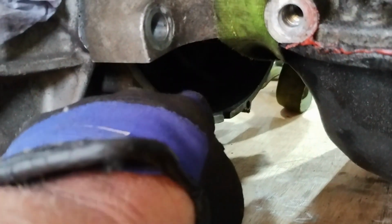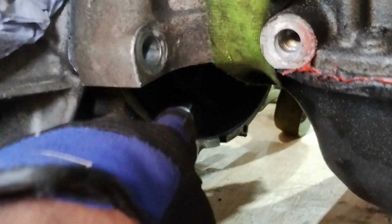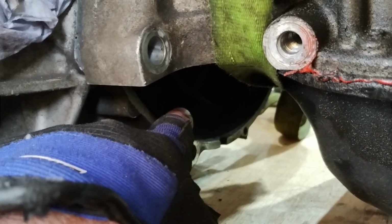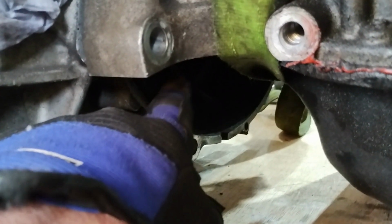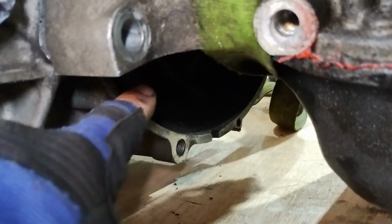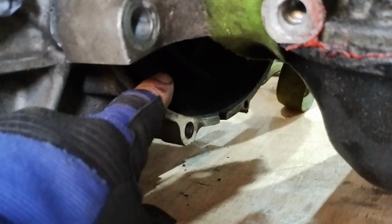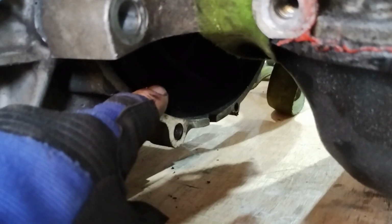I also noticed with it up here, I've got a hole here. Now I know it's a dry clutch and all that sort of thing, but I assume we don't run with dirt and rubbish getting into the clutch, so I think I might be missing some sort of plate that goes on there. So again, I'm appealing to UK series people or anyone who fancies being really helpful and doing a Google search, just see what's supposed to go on there, because the box of parts I had that I thought was fully comprehensive with this, I don't have any plate that will go on there. Yeah, so if anyone knows, let me know. I'm assuming it's just a cover plate and I'll just be able to bolt on a bit of alley or something, but if I'm missing something important, let me know.